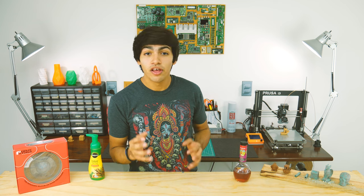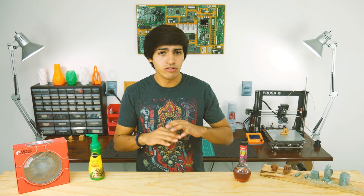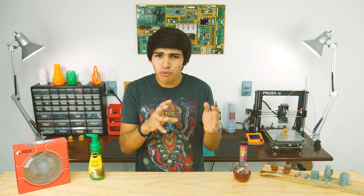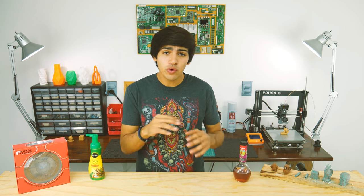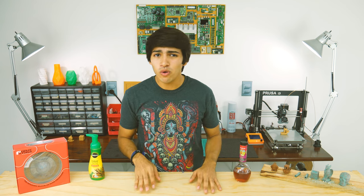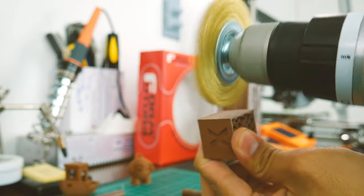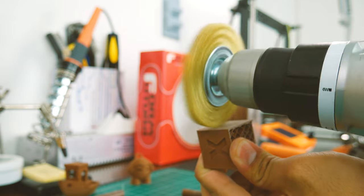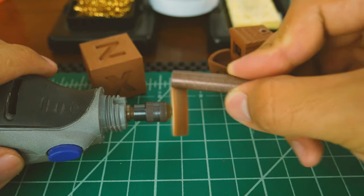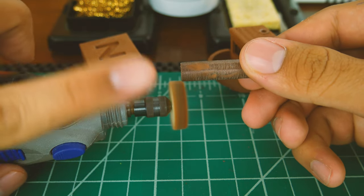About that post-processing: the right way to do it is to place your print in a rotary tumbler until they have been totally polished. Then, if you want to prevent that greenish-bluish copper oxidation, you need to wax or grease the prints. Yet I don't have a rotary tumbler and most of you won't, so I figured I should try other methods. First, I tried polishing the print with a metal brush and a polishing tip on a high-speed rotary tool such as a drill or a Dremel — but that didn't work. Friction created heat which raised the temperature and melted the print.